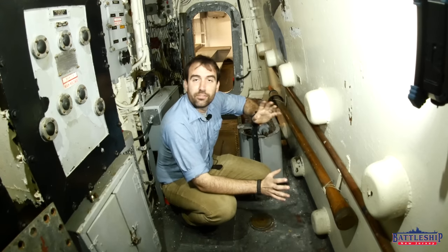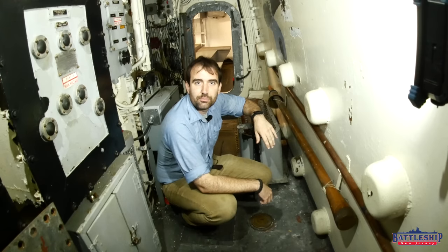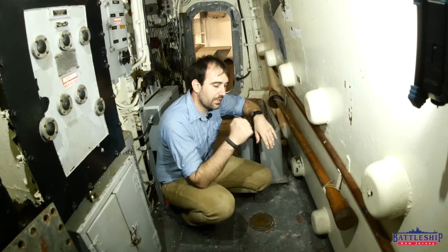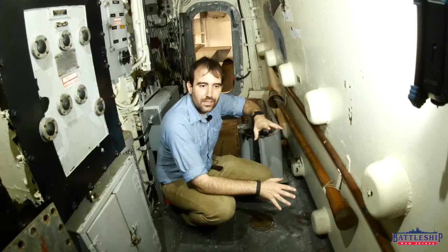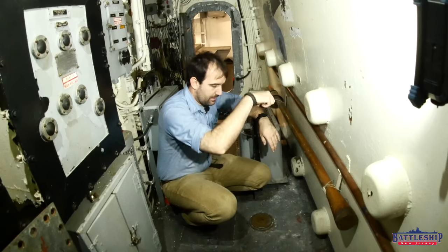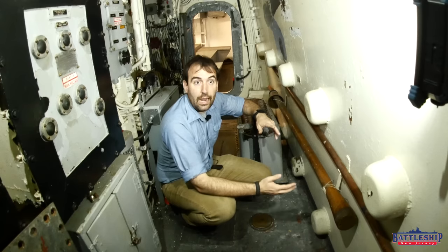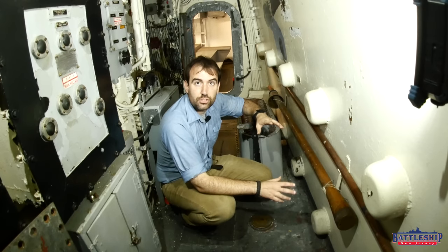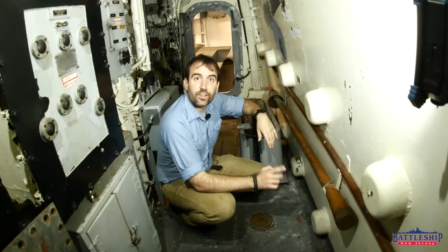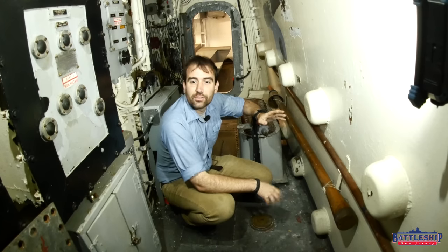Much later on we found out that there is a locking pin to hold the turret in place. I actually found this out by watching Battleship Texas' YouTube video, and there's a link to this one in the description below. On Texas, the locking pin is literally a solid steel plug that you put in place, and there's just a hole drilled in the barbette. I had never seen such a thing on Iowa-class battleships and assumed it was an older feature. The turrets for Iowa-class battleships, in fact, have two locking pins, one on each side of the turret.